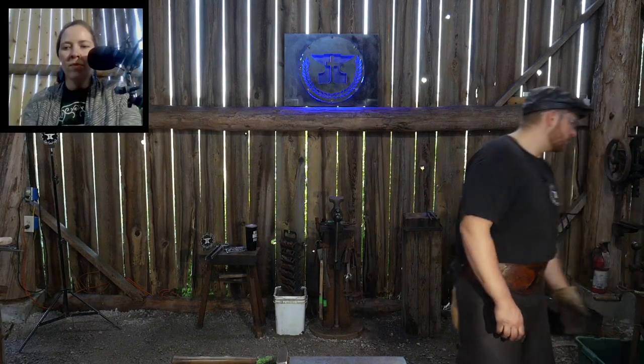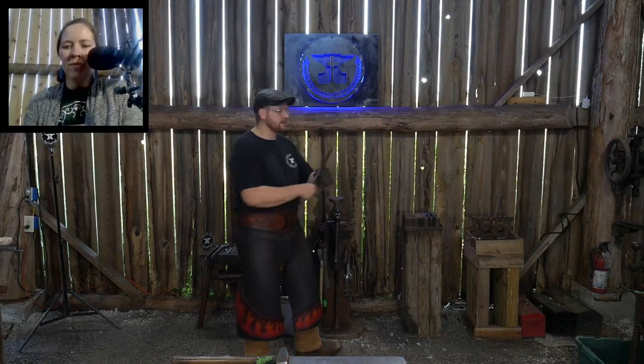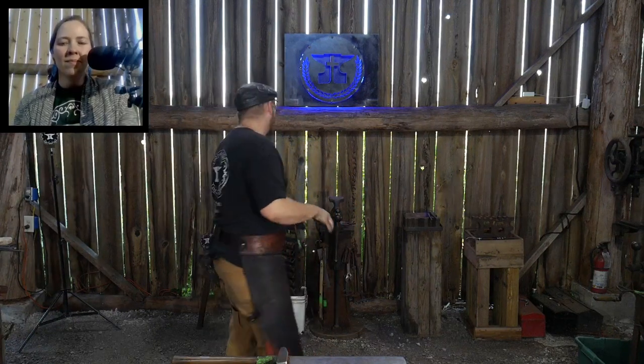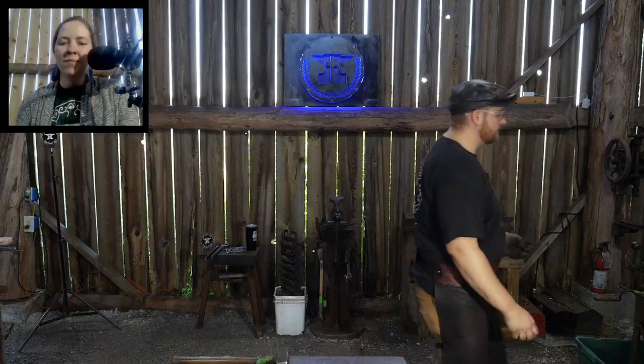Scrolling tongs are meant to be kind of a fine grade tool. They're not meant for taking a piece of bar stock and scrolling it up by hand, right? They're meant to tweak things that have already been scrolled up. Or, for instance, flower petals on a rose. I'll use scrolling tongs with a torch for that sort of work. Very super handy. Again, for horns on a ram's head, very handy for that purpose as well.